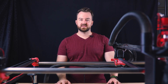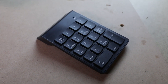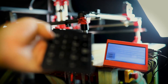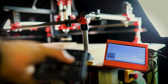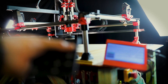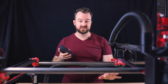Another thing I've improved for safety is this keypad. I bought a really cheap Bluetooth keypad off eBay, and with it I could go into the Universal G-code Sender settings and give each key a function. This allowed me to step away from the machine and go up close to what I was doing. I did the basic X and Y axis movement using the keypad, and the plus and minus for the spindle Z axis up and down. I've also done a reset zero and return to zero function on the keypad.